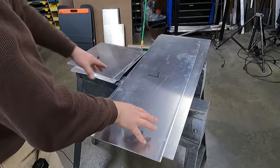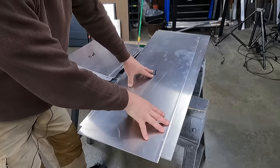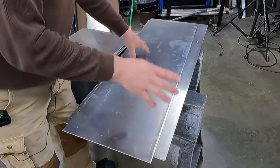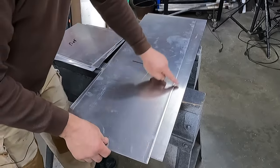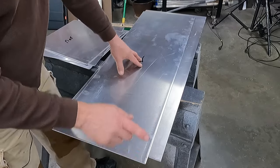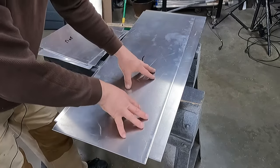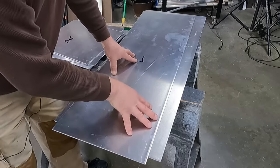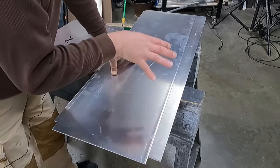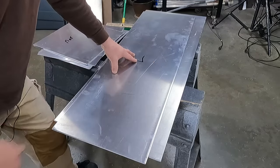And here I have all the pieces I need to build the fuel tank. I did take this to a local welding shop and have them cut it on their shear. The reason for that is there's just no way I could get these long, straight cuts here in the shop and keep them straight and square, because I'm going to be TIG welding on this edge. Also, this is a fuel tank, so it's going to be holding a flammable liquid, and I want it done right.